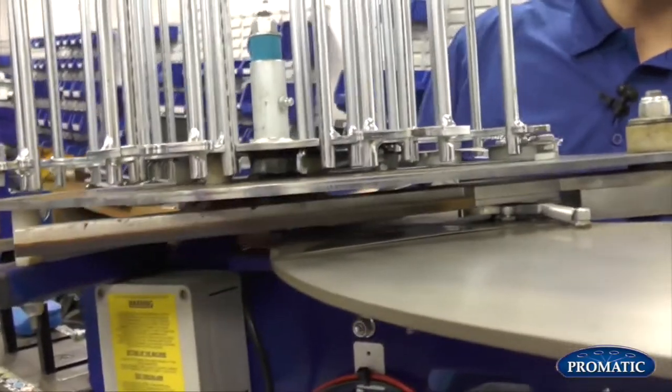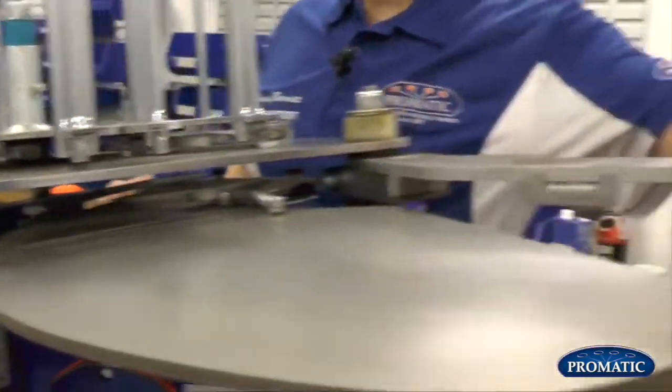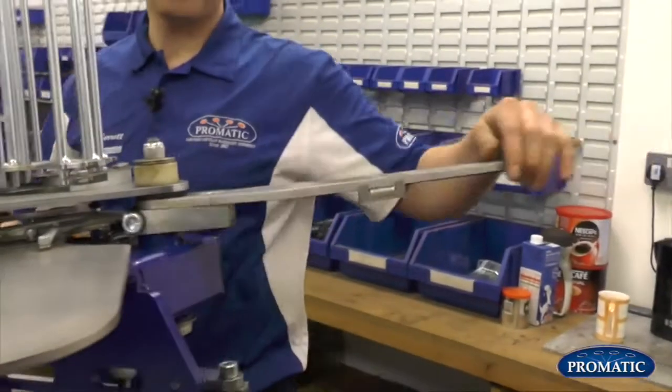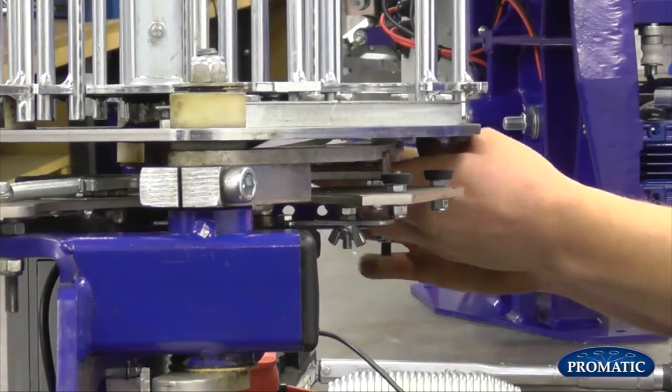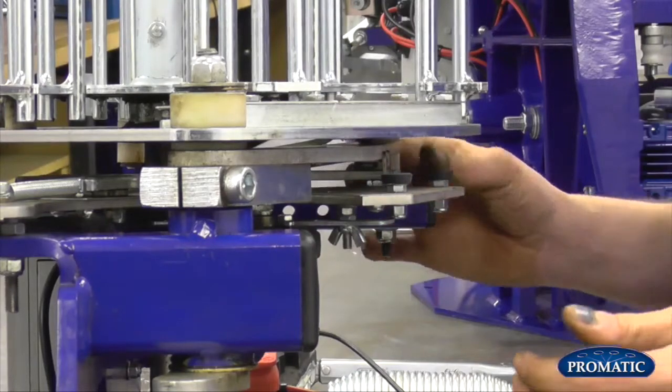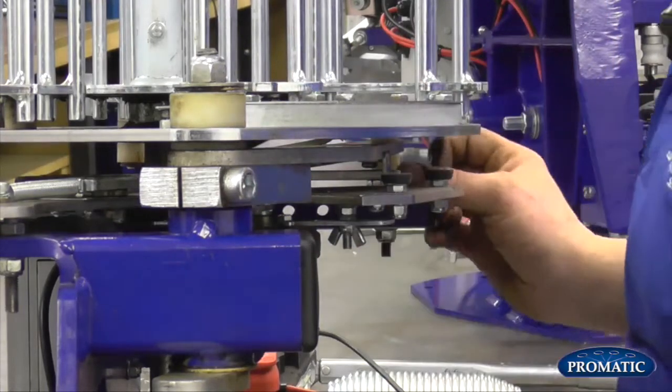If it's set too advanced, what will happen, as we bring that round there now, it could potentially fire there, which is too soon, and that's what caused the clays to break, because the arm is smashing straight through the clays.